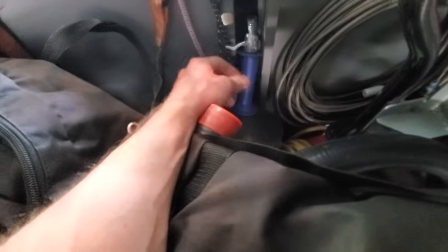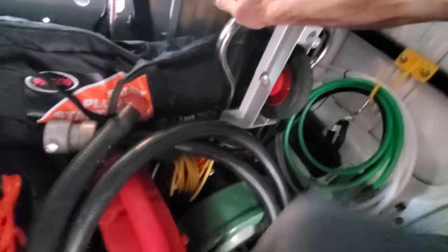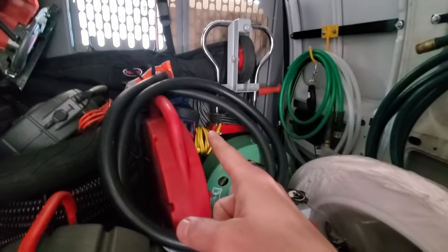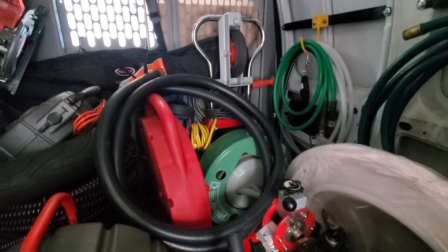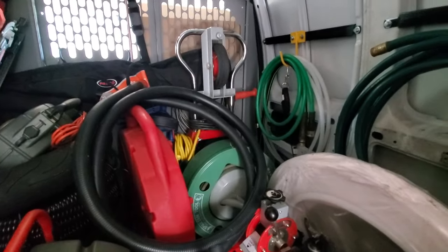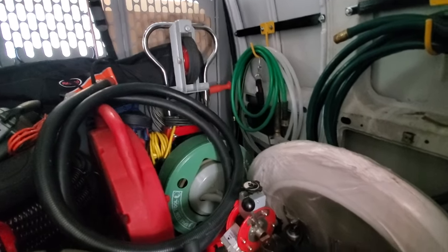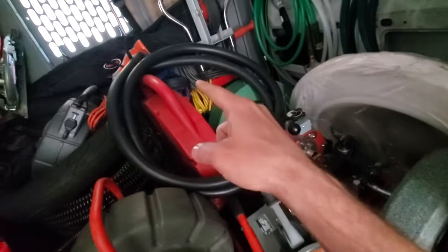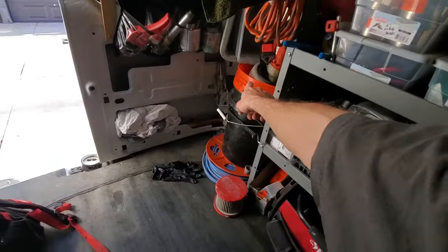The only difference with this guy is that the cable is extremely, extremely flexible. And if you're very careful with that one, you can get it to go through. But the downside with that one is that if the clog is really tough, it has a hard time getting it out because the cable is just so pliable and bendy. So that's why this seems to be the best, because it's a middle ground between that 1/4 inch and this 5/16 right here.